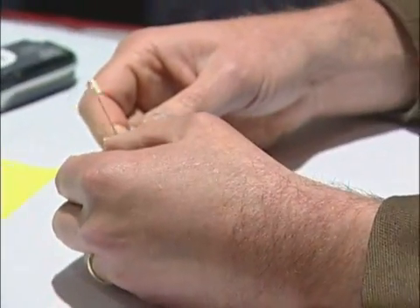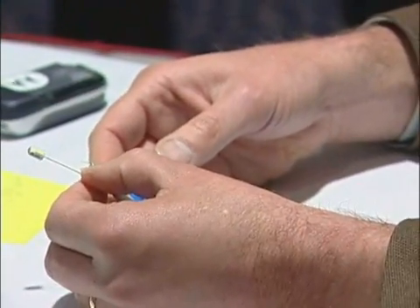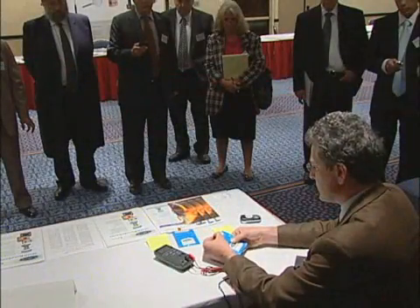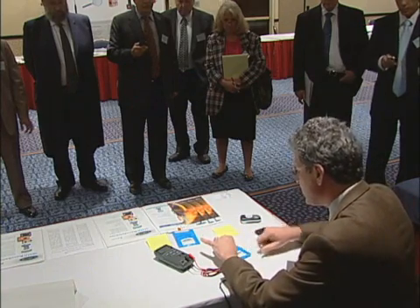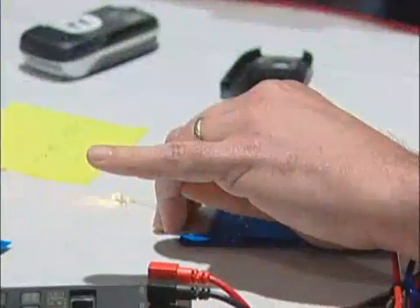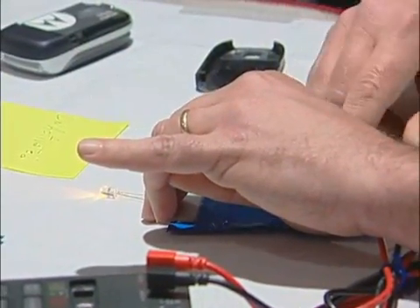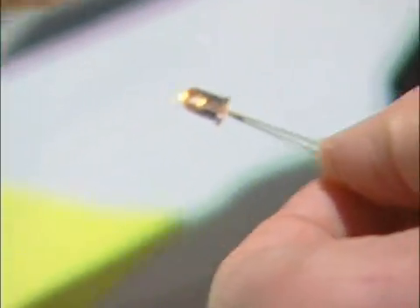Now I'm going to activate the battery. I'm putting my finger on the second terminal so the LED is making contact with both sides. I'm going to activate the battery now. There's a green LED here — there we go. You can see that it ramps up immediately. That deceived me because I thought it was supposed to be a red LED, like on this one here. The LED is illuminated. When I take my finger off the terminal the LED goes out; reattach it and the LED comes back on. I'm going to make a voltage measurement — and there's our three volts.